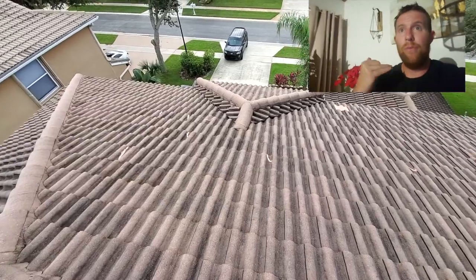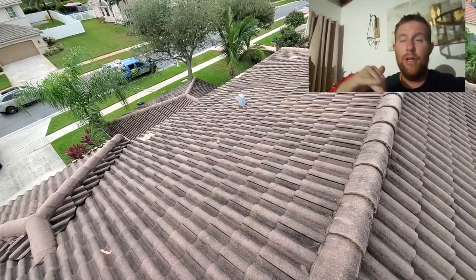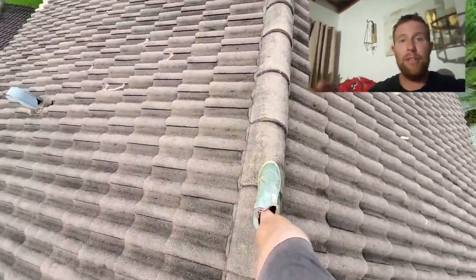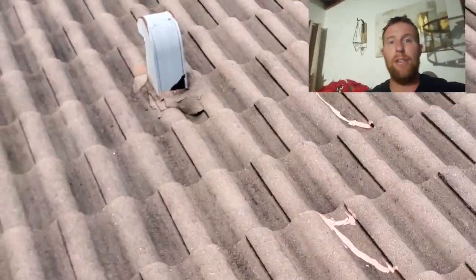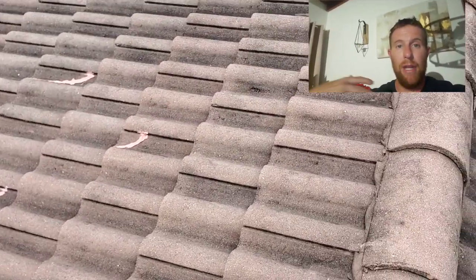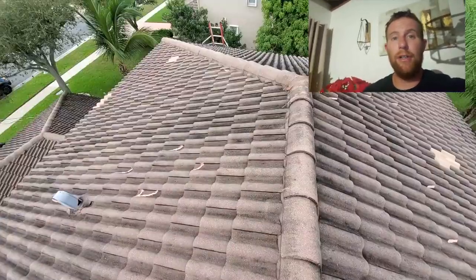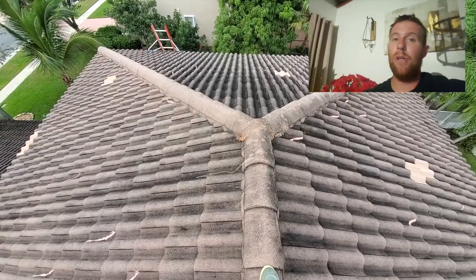And if you don't set your ladder up correctly, with the perfect angle, making sure you have stabilizers on the roof, making sure you're not pinched with the ladder touching the gutter and you're actually on the stabilizers, and you make sure you have your rubber mats down if it's concrete, make sure you have the spikes down if it's grass or dirt. Make sure you have someone there to hold the ladder. That's always your best bet.